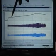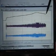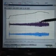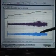I'm going to reiterate stuff on it. Here's the overall engine RPM coming in from startup. Here's your startup. Slight bit of an idle, and then we're just ramping up in neutral all the way up to max RPM, and then actually we're tapering back down. This channel over here is the actual engine torsionals, and you can see that at startup, both the engine and then the drive shaft here go ahead and have a bit of a torsional influence at startup, which is typically how you want it. But the nice thing is that this is fairly consistent, continually increasing until you get to max RPM, and then it'll start tapering back down.